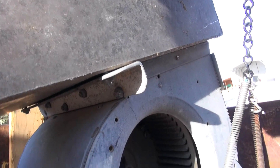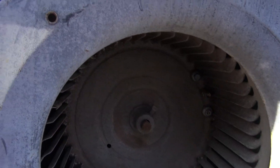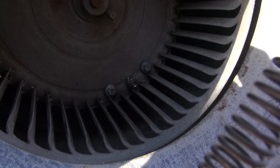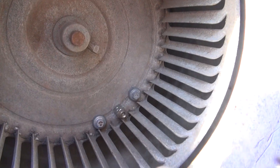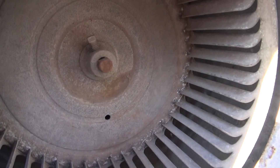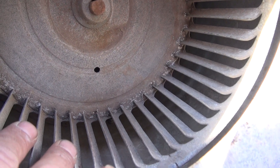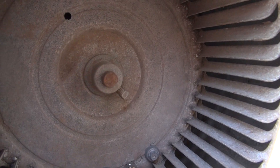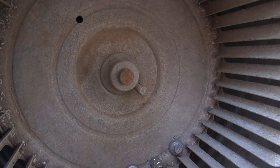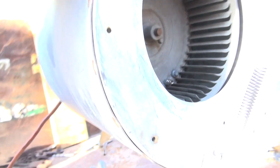What I've done here is attach a squirrel cage fan up underneath, and I've offset some bolts — you can see the bolts down there — to offset the squirrel cage so it jumps up and down. I couldn't put the bolt there because it was too close to the motor, so I had to go all the way to the outside to accommodate this. You can see the attachment to the fan is right there on the motor mount. It's a split squirrel cage fan, so it has entry from both sides.